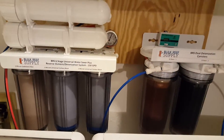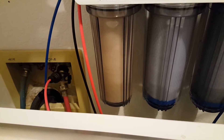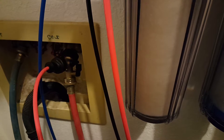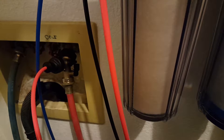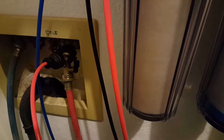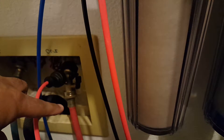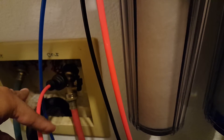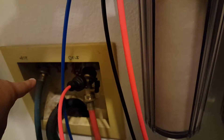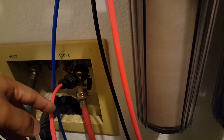In terms of my system specifically, I have it set up to where it feeds off of the water supply to the washing machine, where I picked up a two-way valve at Home Depot for about $3 or $4. The lines on there say cold up here and it has the hot water line on there. I'll address that quickly — when I had this line on the hot water side it was leaking, so I just switched them out and everything is working perfectly fine.